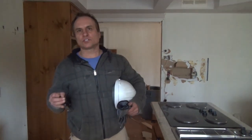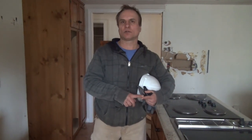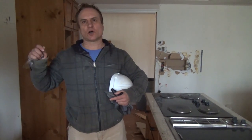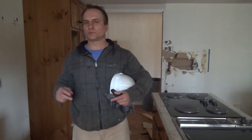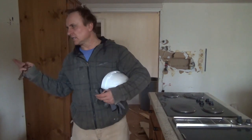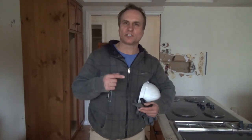All right. Now, before you start taking things apart and ripping things apart like we have, there's a few things that you should double check. Have an electrician come over to check your panel to make sure you can turn your breakers off or your main switch, your main hydro breaker, off, so there's no power coming into the house, because when you're ripping apart, you don't want to hit any electrical lines that are live. Make sure your water's turned off, because you're going to start cutting things and ripping things apart, you don't want to all of a sudden hit a water line and have water all over the place.